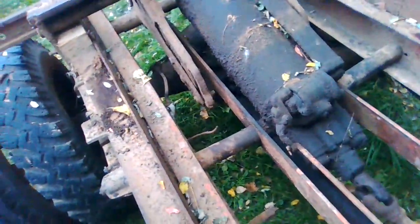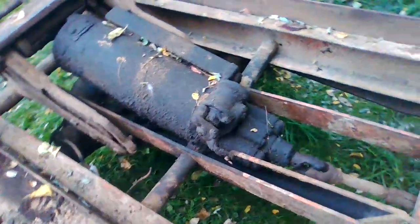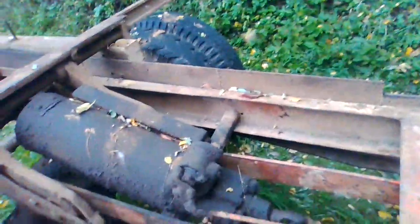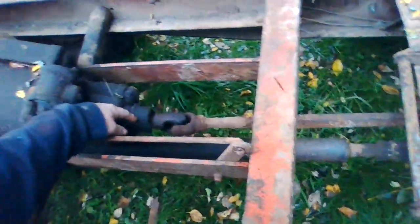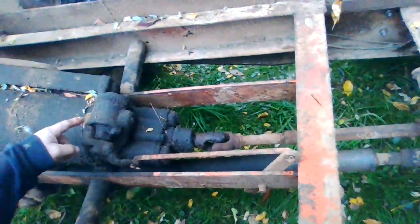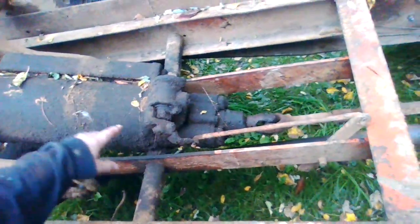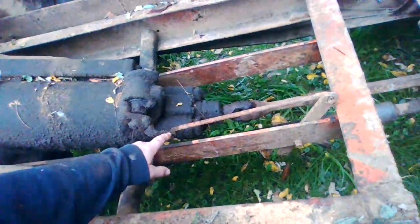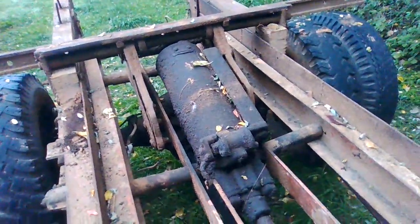This is a scissor lift that came out in the 40s for the earlier dump trucks — it was the first hydraulic unit. Before this you would have had a big gear system that lifted the body. The PTO turns this shaft, this is the pump, the valve body, the piston. The oil moves from one side to the other depending on whether it's going up or down. As you move your lever, it takes the oil from the back of the piston and moves it to the front, which raises the body. It's an old system — some people turn these into log splitters and they make really good ones.